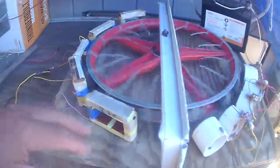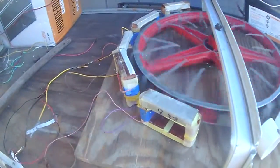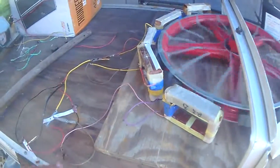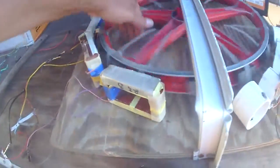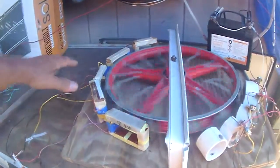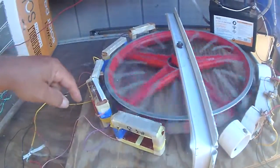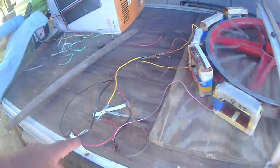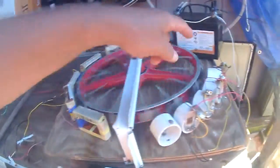This has four high windings of the microwave oven transformer that I pulled off the transformer to run these, and I get about 17 to 20 volts at a good RPM on here — AC, it's about 17 to 20 AC. These go up to a certain revolution and they kick in. So these five high-side windings of a microwave oven transformer are running AC. These are running north and south, these are also running north and south magnets. And it's not even put on a bridge rectifier or any capacitance — it's just running free AC right here right now. So that's the AC side; these are pulsed DC.